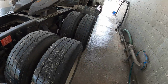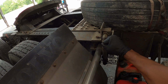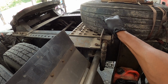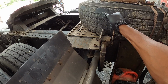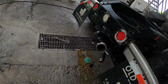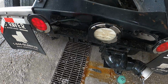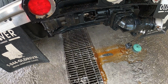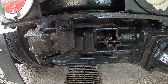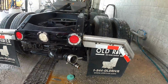Okay, and now I'm going to engage the pump. I'm going to slowly engage it. You can hear it. Loosen this up because I got it on the stand. The shaft, it's been repacked already, so the packing gland has been repacked and it's running. So now we're going to go ahead and rinse it out.